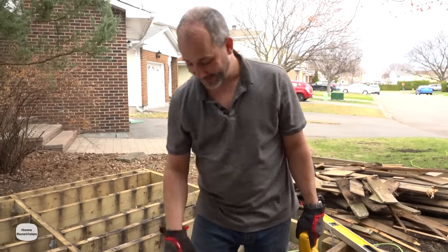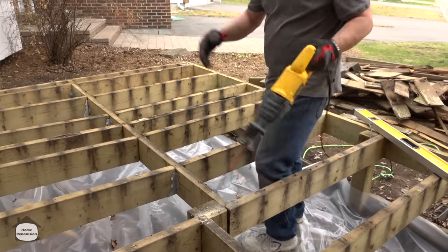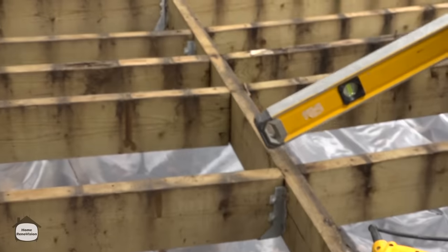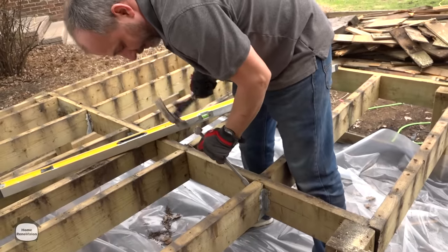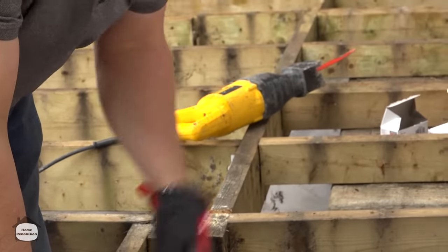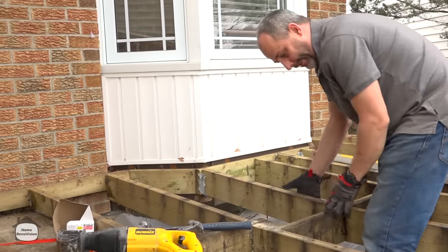All the weight of sinking into the ground had this board under pressure and bent over — now that the pressure is gone it's popped up. That's awesome. In the same fashion we're going to keep this 16-inch line and this piece of two-by-six as well, so we don't have to replace the entire carriage area. We'll cut this one too since it's going to be removed anyway.